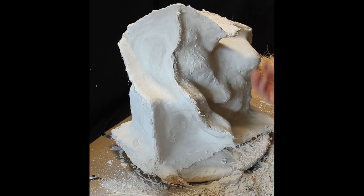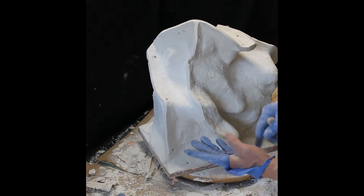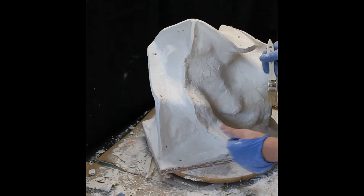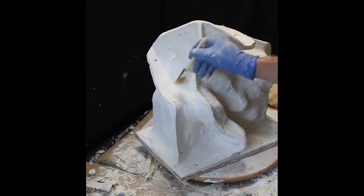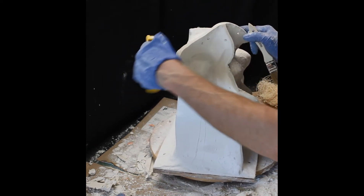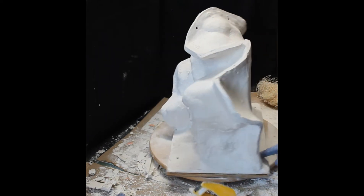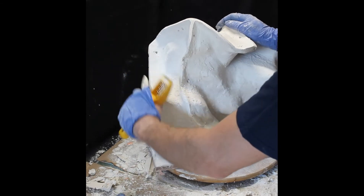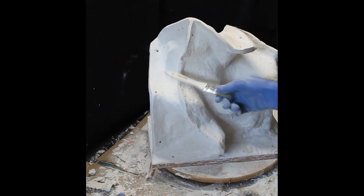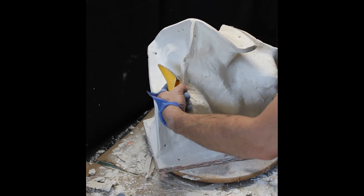I can make some type of plug and then strap it into a rotational casting machine. This is cured — this is the next day. Plaster is very drying, to the point where even nitrile gloves wear out pretty quickly. I used a sure-form to go down the side. I did drill a quarter-inch hole through the bottom in case I elect to use this as the base, which I likely will. I took a marker — still see some traces of felt-tip permanent marker — and pre-marked before drilling.